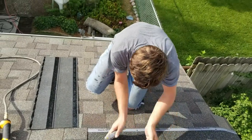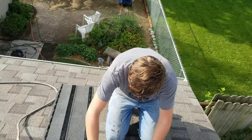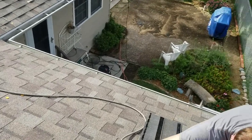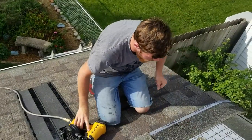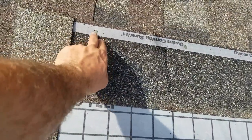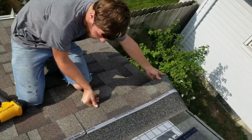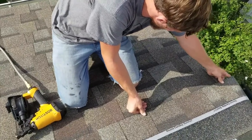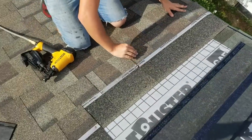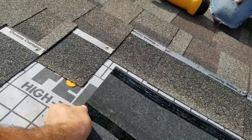For the most part all these boys got the basics down. This is the first time I'm seeing Zach shingle and I can tell he's already got the basics from another company he's worked at or watching my videos. Nice little three-nailer. I still don't like how close that is — it's fine, I'll let it slide, I think it's not going to become an issue but I want you to get more aware of that. Since you cut that one perfectly straight you can't really butt it — you got to actually look at the line on this one.